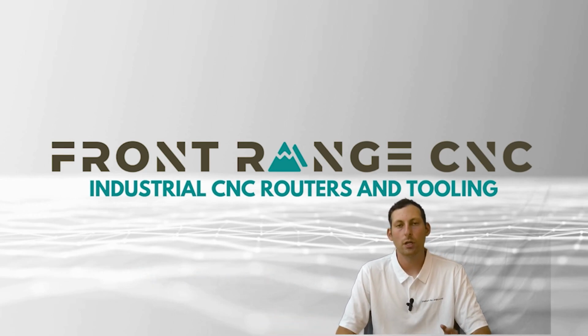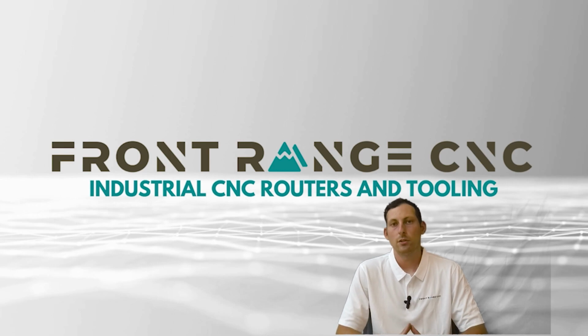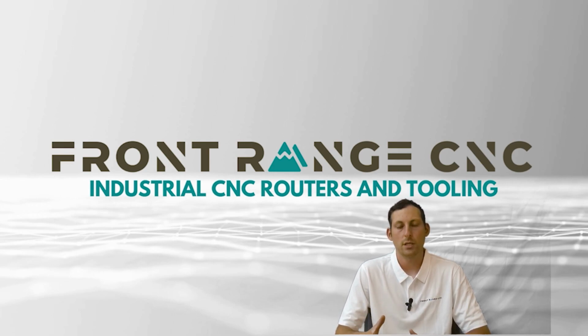Today we're going to go over some different terminology for tooling, often called router bits, and this will give you a better understanding of what kind of tooling you might be looking at as you're starting to get into the CNC router process, especially on a larger industrial level, now that you've got ER32 collets and access to a little more horsepower on the spindle. You've got more options than on a smaller setup.